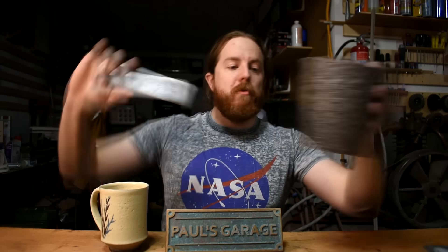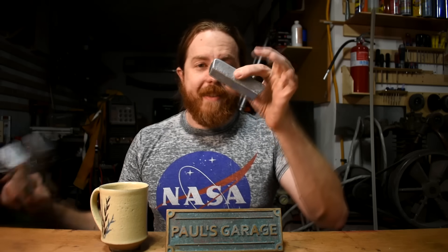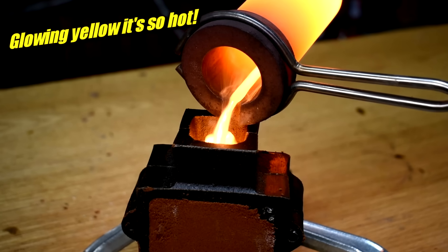These days you can get a zinc alloy in small chunks that fit in the electric crucibles from Rotometals. This is ZA-12 — the old way I used to buy it was in giant ingots that barely fit even in larger gas furnaces, but now Rotometals sells them in a considerably smaller size that fits in an electric crucible. Bronze is cooler looking in general and a bit more hardcore, but it takes an extra thousand degrees — more energy, more wear and tear. If you want my opinion, ZA-12 for beginners is the metal to go with. It's low temperature but not soft like pewter — in fact it's tougher than aluminum. It's also cheaper by a lot. Buy ingots of this stuff. Don't use scrap metal if you're new. Seriously, you'll eliminate about 50% of your casting problems right off the bat using clean metal.